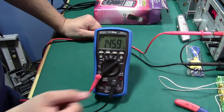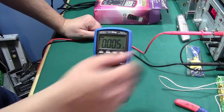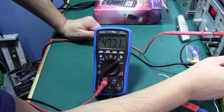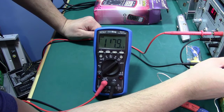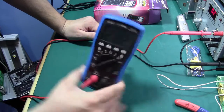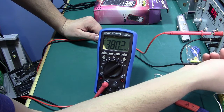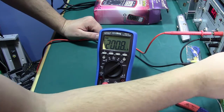Crank this all the way up — 1.46 amps. Those are rounding up a little bit, but that's really nice. Turn the load off for a second, put this into the milliamps range, turn the load on, and we'll slowly bring this up. It does 100 milliamps, 200 milliamps — that's the maximum fuse for this, 600 milliamps it says. I imagine you can at least do 400 milliamps and be alright. The range switching is a little slow, but nothing major.